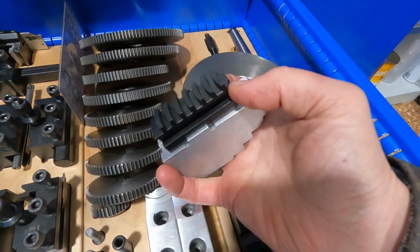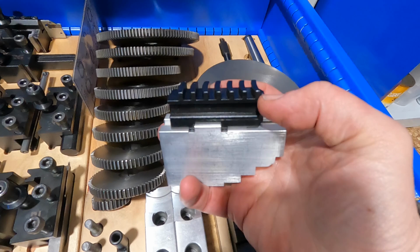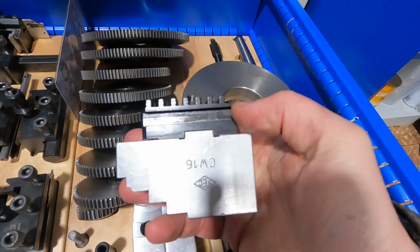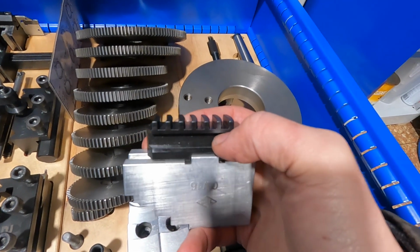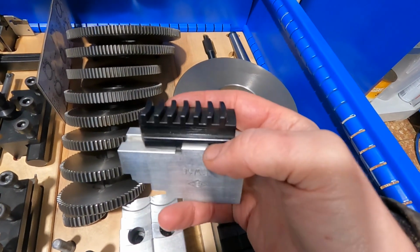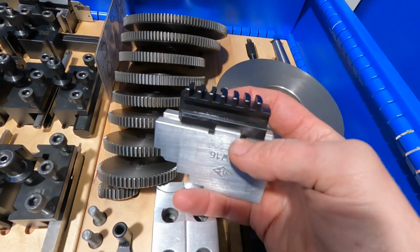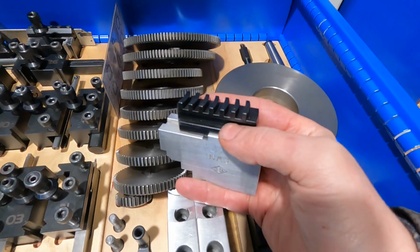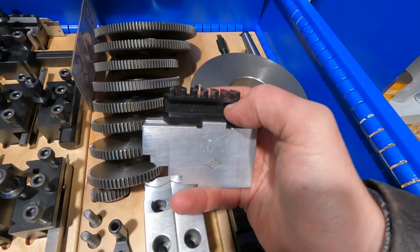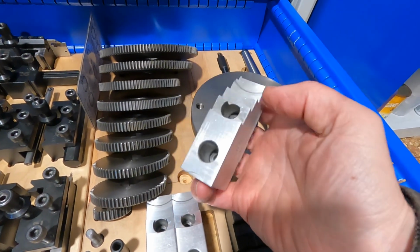And in order to have those carriers more durable and give those a longer life, I send them out for surface hardening. And I was afraid that the fit of those carriers would be messed up due to the hardening treatment, the fit in the body of the chuck. But the nitriding solution, sorry, I meant nitriding. The nitriding solution turned out with no problems of fit of these jaws in the chuck body. So this worked out very well, I must say.